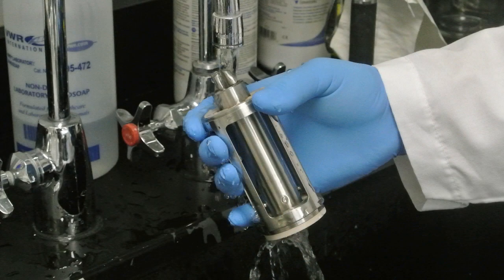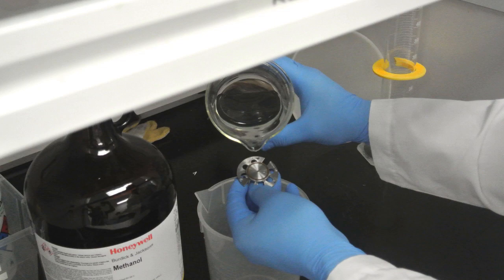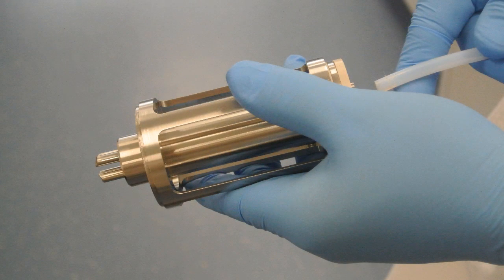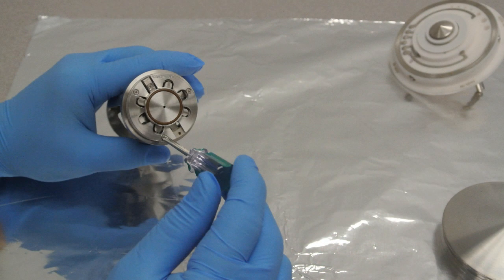Pour hot tap water over and through the ion guide for 3 minutes while rinsing any soap from your gloves. Make sure that all residue has been rinsed away. Watch for evidence of water beading on the surface to confirm that the ion guide is clean. Rinse the IQ-0 lens and isolation shield with hot water as well. Under a fume hood, pour 100 to 200 milliliters of isopropanol or methanol over the ion guide, IQ-0 lens, and isolation shield, making sure it is applied to the entire surface. Catch any waste and discard it into the appropriate waste container. Use clean dry air or nitrogen to dry the ion guide and related components and be sure to remove all droplets. Wipe off any remaining spots with a lint-free wipe dampened with isopropanol or methanol. After drying, using the screwdriver, reassemble the Q-Jet ion guide by reattaching the IQ-0 lens and isolation shield.